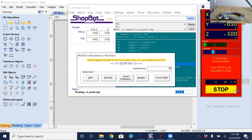Basically, that's what it does. It moves, scans, and goes over, and you see right now the Y value is at that 0.01. That is our scan resolution. That is how far it is stepping over. So if we had our scan resolution set at 0.005, 5,000ths, the Y value right now would be reading 0.005. So that is the reason that the closer together those lines are, or that step over is, the smoother your finished model or your finished scan is going to be.